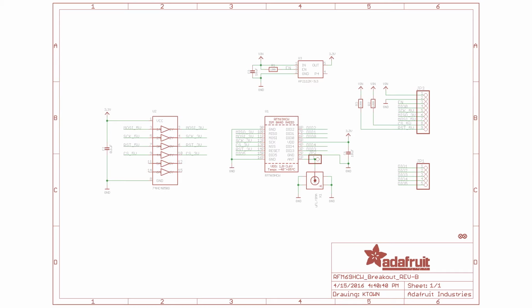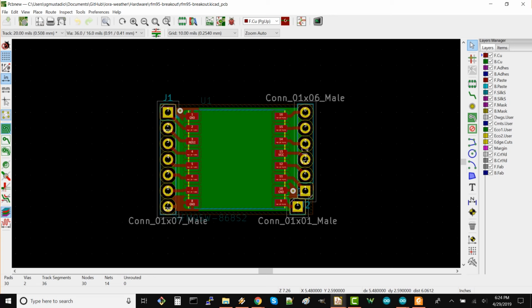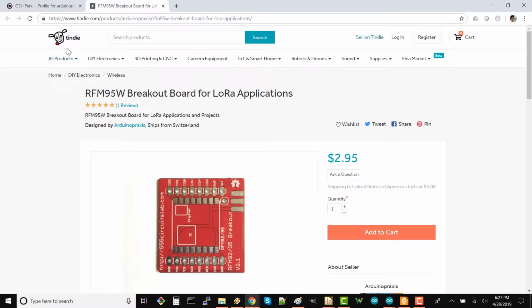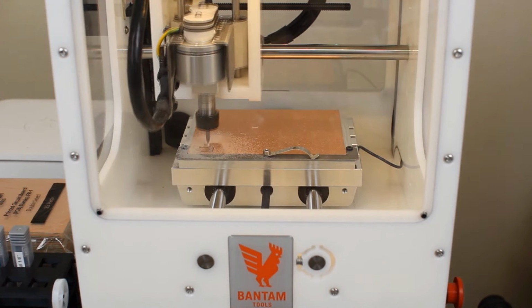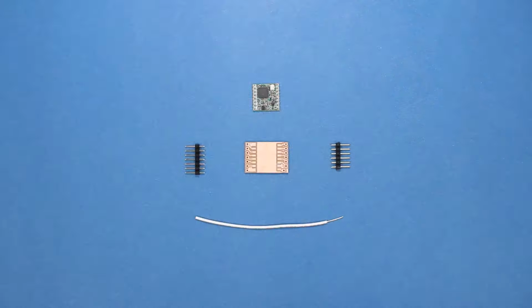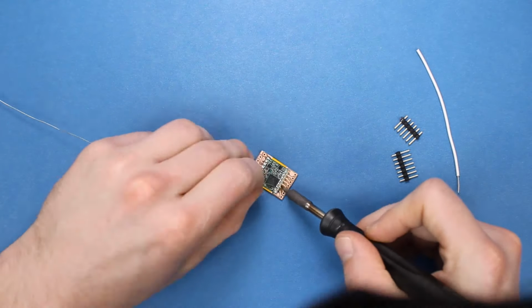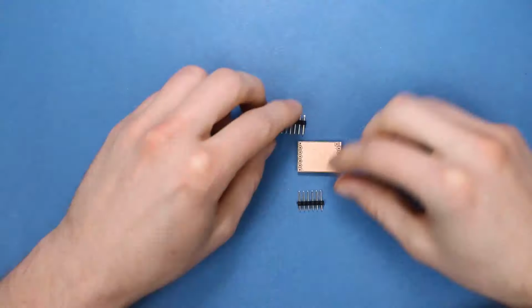This happens again with the RFM95. Adafruit added extra components to make it work at 5 volts, but we don't need them. SparkFun doesn't have an RFM95 breakout, so I made my own. OshPark user Arduino Praxis also has a design available if you want to use that. The design files for my board can be found in the GitHub repository link in the description. I milled it, but you're welcome to get it professionally manufactured. If you're curious about milling boards, I recommend checking out my Creating PCBs for Rapid Prototyping series on this channel.